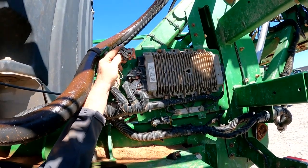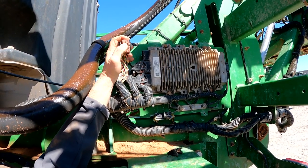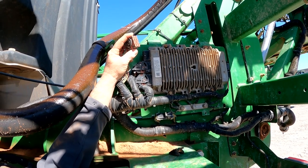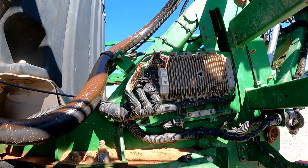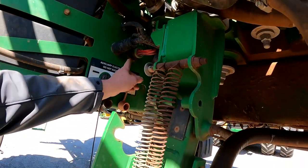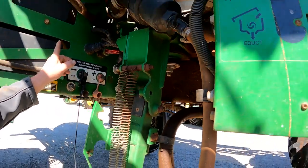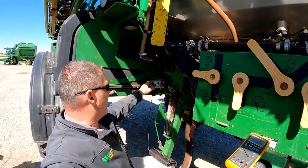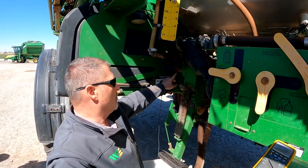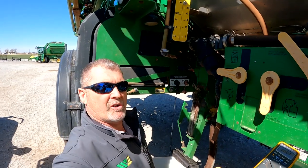At this connector on the SRC controller, L1 is our 8202 circuit. We found that we still did not have unswitched voltage on that pin in that connector. So we backtracked in our schematic and also looked at the XX56 connector. The 8202 wire runs from the fuse block under the ladder through the 10-amp fuse to the XX56 connector. We found that we had voltage on 8202 at that connector but did not have voltage at the controller on L1.